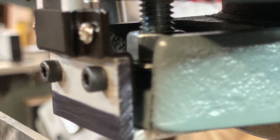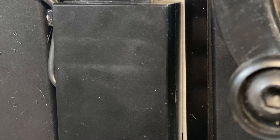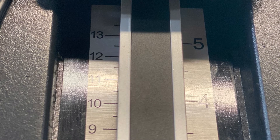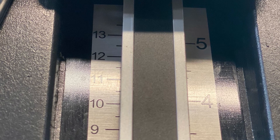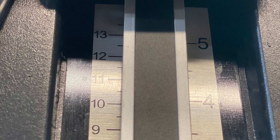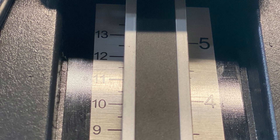What makes this even simpler is that that rod used to sit in a collar that supported your quill stop. The over-dimension of that hole makes it such that we can move the bracket in and out so the back of the reader on the beam sits flush with the faceplate, which is already perpendicular to the Z-axis of the mill. Now all you do is simply attach the back of your reader to the front cover with some 3M double-sided badge tape — that stuff is strong as steel. The only additional modification you may have to make is opening up the front of the top cover where the beam meets it, which allows the beam to travel up and down inside the cover when you move your Z-axis. The last step is to route the wire they give you on these things to the back and secure it.